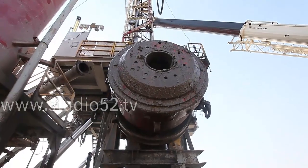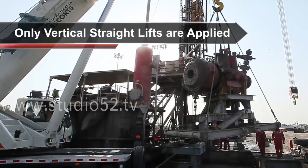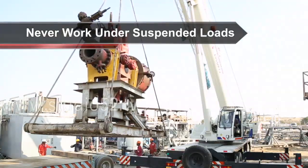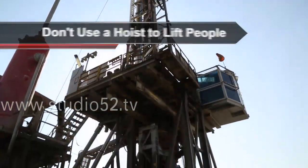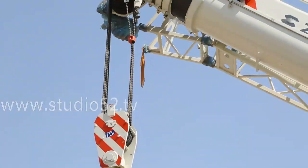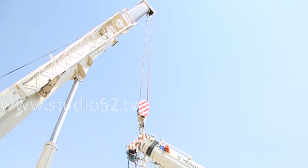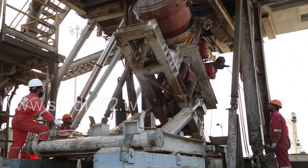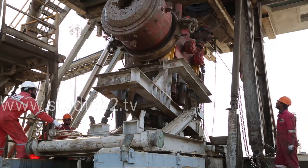There are a few basic safety factors to consider when handling BOP. Ensure only vertical straight lifts are applied. Never work under suspended loads, and by the same token, never lift loads over people. Do not ever use a hoist to lift people. When leaving a hoist unattended, land any attached loads. When you are at the controls of a hoist, you have a lot of responsibility — your co-workers are counting on you to use skill, good judgment, and common sense.